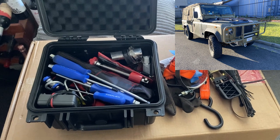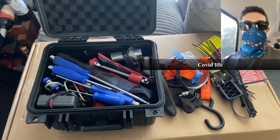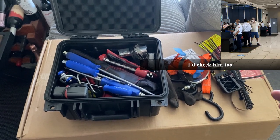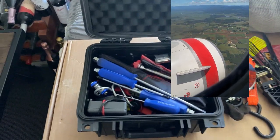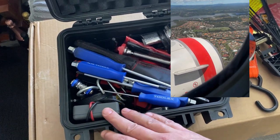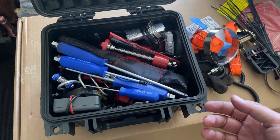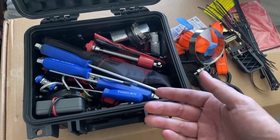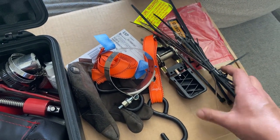This might be of interest to people who travel and do things with their cars, or want a toolkit for extended journeys if you don't have roadside assistance. These are the things that have gotten me out of jail over the years — if I hole a radiator, break an exhaust, screw some suspension. A multimeter is pretty precious if you need to diagnose electrical faults. Always have a few fuses — you can always pinch one to replace one that's more important. You can't get away with something critical like a fuel pump, but you can do away with indicators in the worst case.